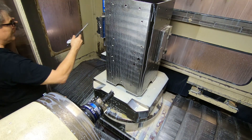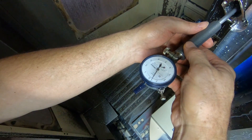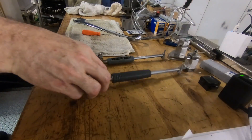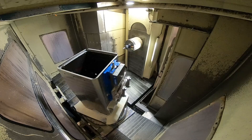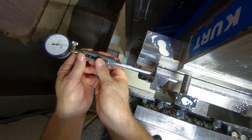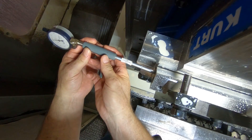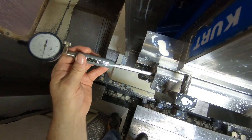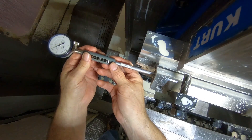The way I usually set bore gauges is to stack up gauge blocks. Here the bore is measuring about two ten-thousandths plus, which is fine — the tolerance is plus or minus two thousandths, so that's plenty adequate. I put a block delete in the program and use a go-to statement to go to the beginning of the boring head routine so I don't have to keep restarting the program. With the block delete key pressed it'll skip past that. Here I'm checking the other bore — since I milled it, I'm checking it at different angles for any out-of-roundness, although this machine generally mills circles within about three ten-thousandths roundness, so it's not usually a problem.